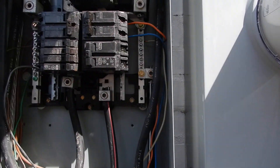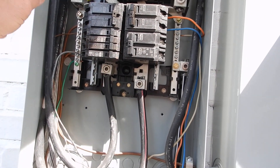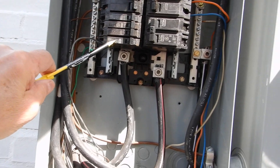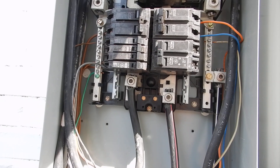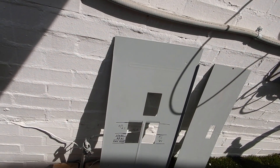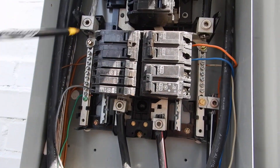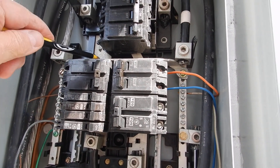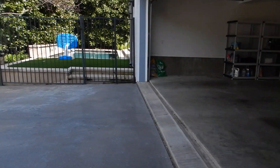That's the main. Do we have two mains? If we've got two mains, this is okay. But it doesn't look like we've got two mains, because there are only two breakers in here that are being operated — it probably goes with the swimming pool equipment. So this doesn't look like a main panel to me. The electrician is going to tell us whether we need to take that bar off or not, but it looks like that bar should have been removed. We've got a second panel.